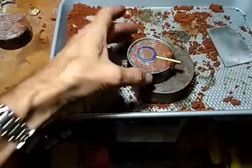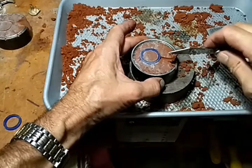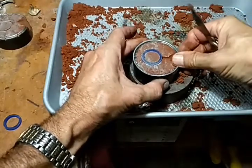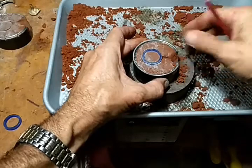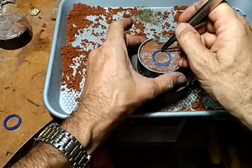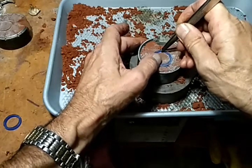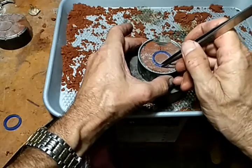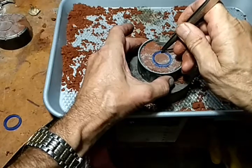So now the second half, take our little sprue out of there. Cut this back. Pack it down good. Okay, now the next thing is we got to free up the wax. Since it's round, we can almost spin it maybe. Once it turns a little bit and breaks free, it should pull out fairly well. No reason to rush it.